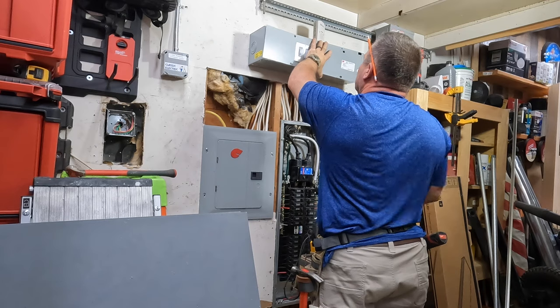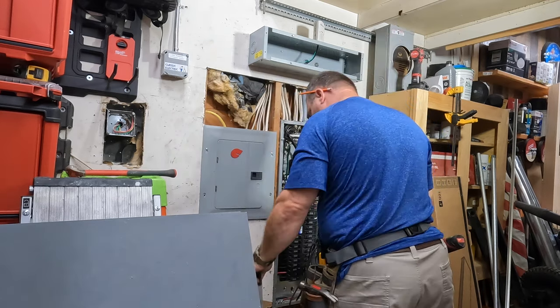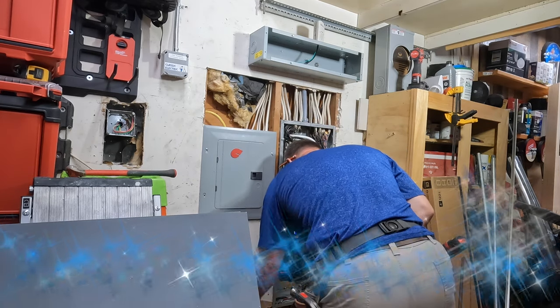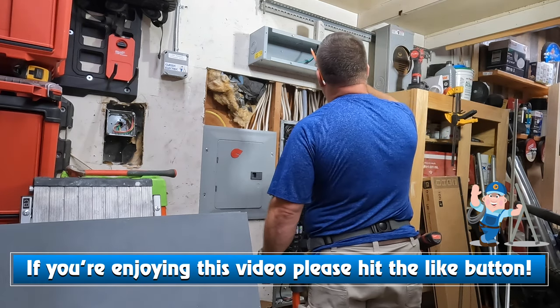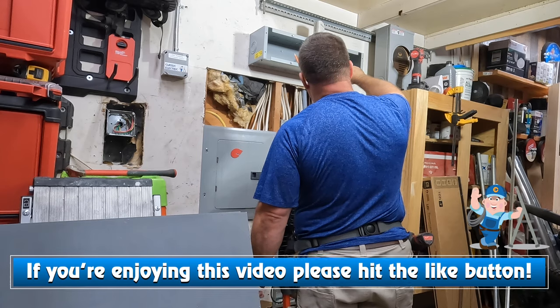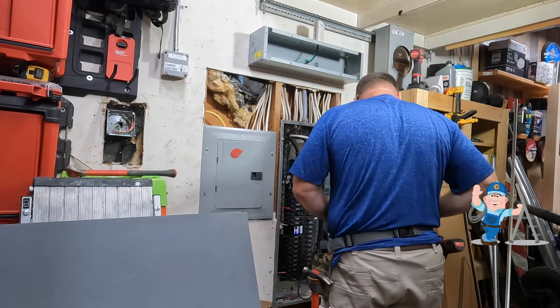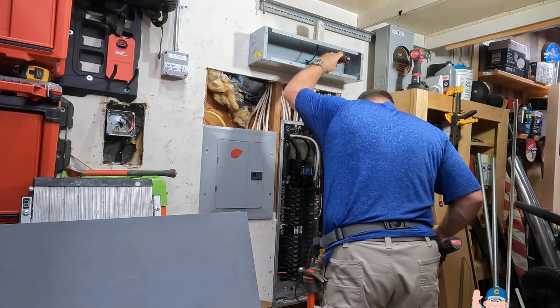Now I know exactly where it's going to go — I'll take this panel cover off and get the wiring attached. You can see the watt meter on that cover. Eventually the generator wiring is going to go through those current transformers, and that's how it's going to read before it goes down to the generator breaker inside the main breaker panel with the interlock.